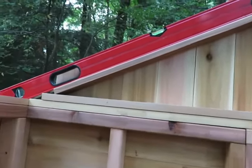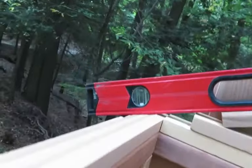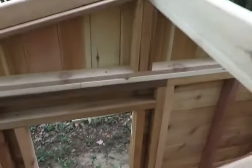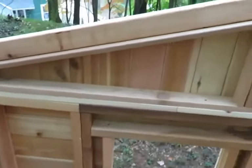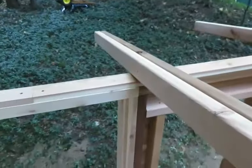When first installing the gables, only put two screws in because there might need to be other adjustments. Use a straight edge to check that angle on the back. The instructions have you go and put the windows in first and do all this trim stuff and even build the front porch. I'm going right ahead and getting the roof on so I can put all the material.